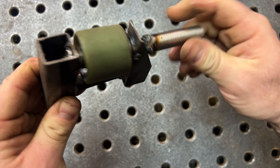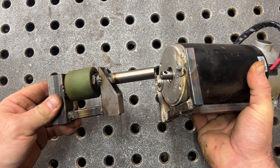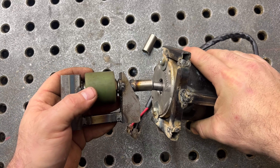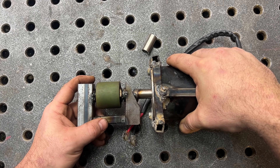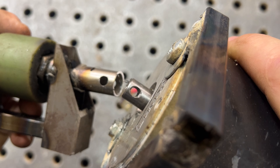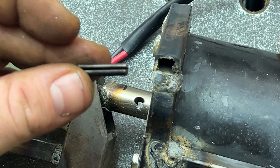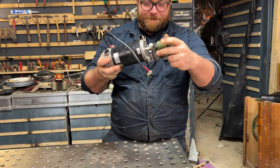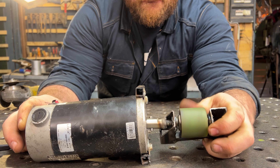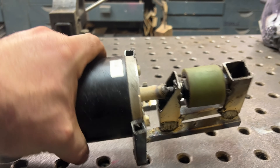I then take a skateboard wheel — this is a very small one — and I weld a little frame so that I can hold it. Now I can connect the two parts with a stainless steel tube. It's a bit long, so I can cut it to dimension. I just drill a little hole so I can connect and let all the parts spin together — so the motor will spin and also the skateboard wheel will spin with it. I take a metal pin and push it inside to connect the parts. This spins freely, and it's very important to have some play between the two parts, because it's very difficult to align the motor precisely with the wheel, so having some movement is a great thing.